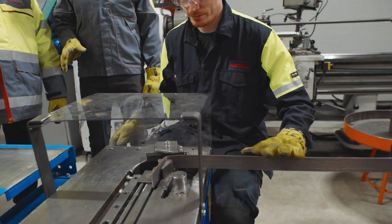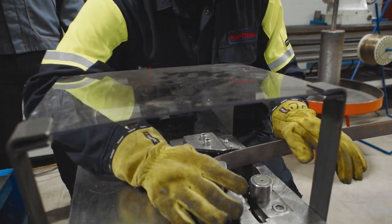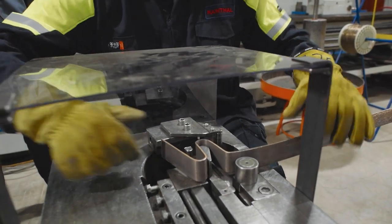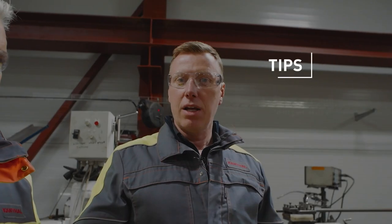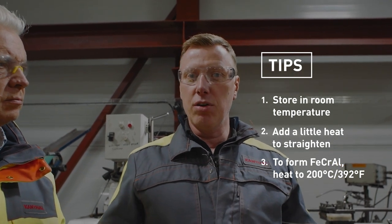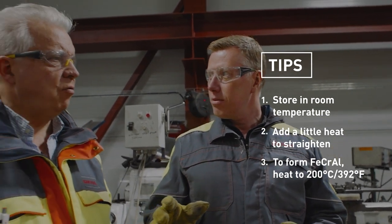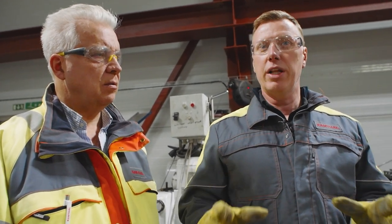How is the material going to react differently this time to when it was colder? The material gets more ductile when you heat it, and there is no risk of breakage. If you are looking to form strip elements, we usually have two materials: Kanthal — this one is Kanthal AF — and Nikrothal, which is a nickel-chrome element. Both of them, if stored cold in a warehouse, bring them in and let them get up to room temperature before straightening. Add a little heat before straightening, and always remember, if you are going to form a Kanthal element, we need to add heat — around about 200 degrees. We normally recommend heating to 200°C, and then you will get a really good formed strip element.